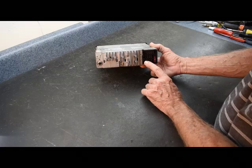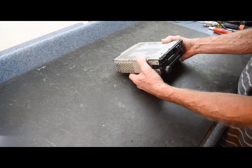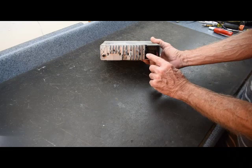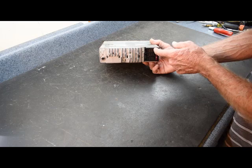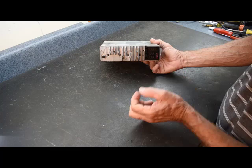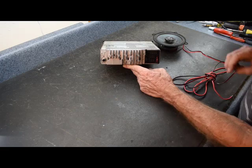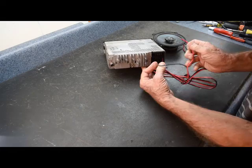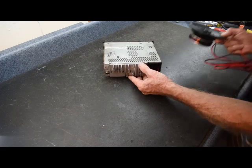Now that will take care of the power issues. If you're checking audio in the car, there are three connectors on the back of the stereo: the main power in and out, one for speaker output, and one for the CD changer if you have that. If you have no audio, you can remove the center connector by itself, take an external speaker, and touch the speaker leads directly to the contacts. This can test the output from the radio, which probably puts out 7 to 15 watts, so you should hear something. If you're getting static, we know the problem is in the radio.